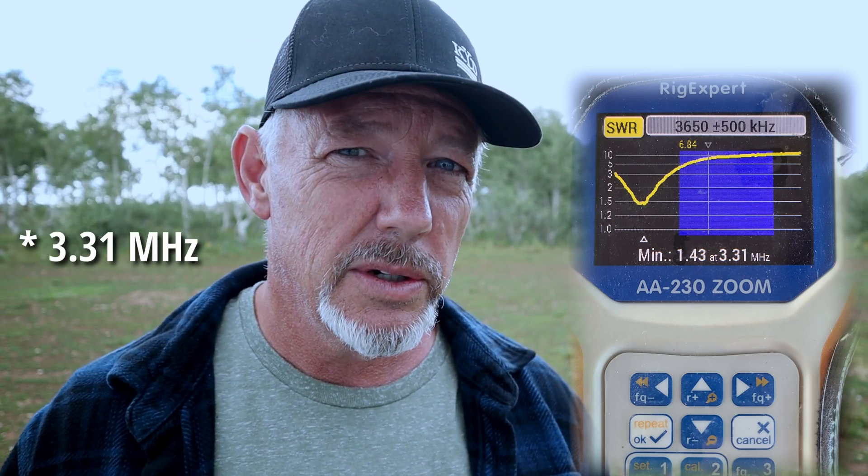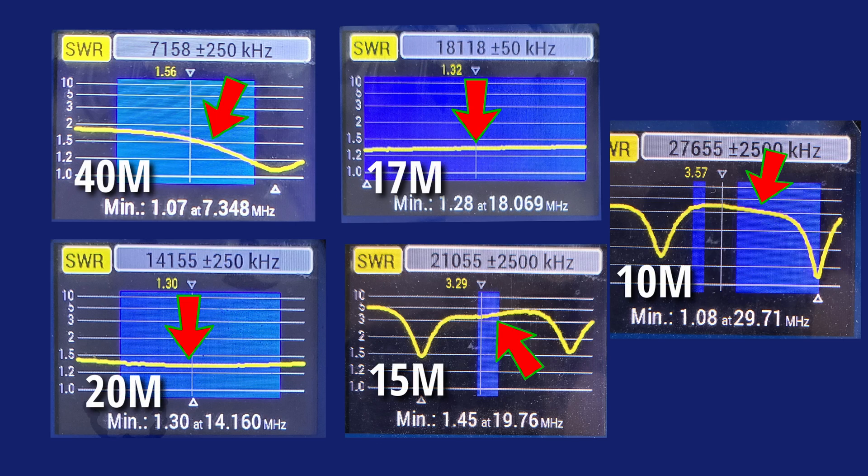I took my 288 feet looped around the campground — the antenna was only five to ten feet off the ground — and kept it at my height so I could work on it at the camper, and that's where I started to tune the antenna. I hooked up the analyzer and found that the 288 feet put my resonant frequency at 3.4 something. Looking at the rest of the frequencies on 40 meters, 20 meters, 15, and 10, everything was shifted lower just like you'd expect. So I started chopping, taking lengths of wire off until I got closer — close to 10 feet needed to be removed. When I felt the antenna was right where I wanted it, I raised everything back up.